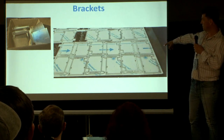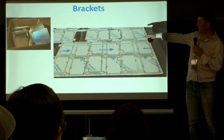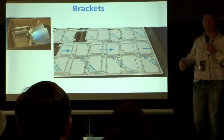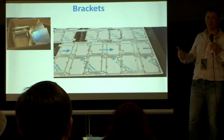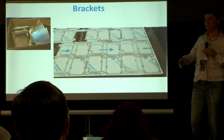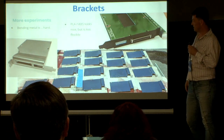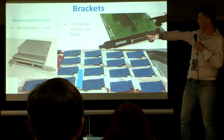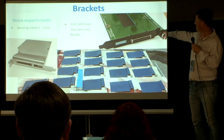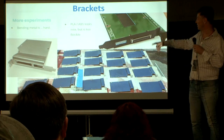It's better to make something proper. This is a photo that Simon sent from the production line — they were all laser cut and then bent. I had long discussions with him about the double bend you see there, which keeps the pins safe. He asked if we could just optimize it away and put a hole in instead, and I said yes that would work, but can we try to do it anyway because it would look much closer to the original? These double bends need a lot more sophisticated machinery, which is the problem.